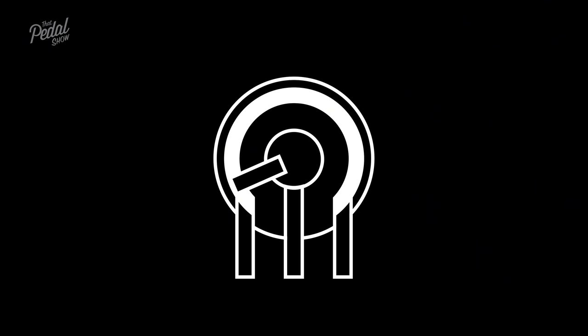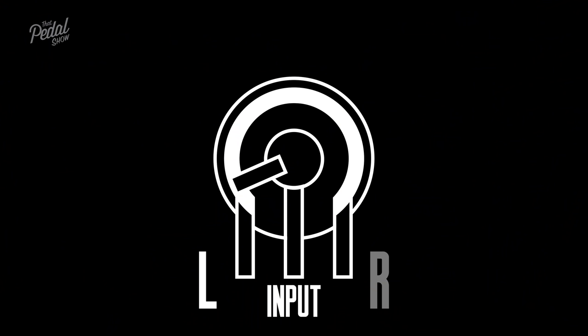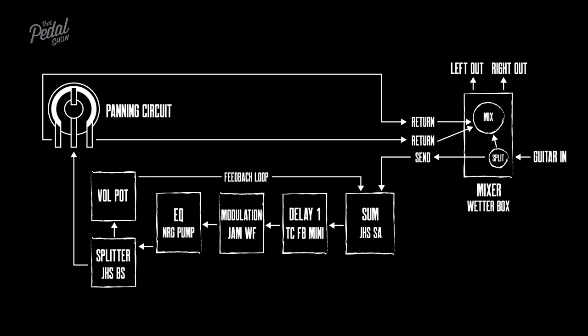If I have my pot right in the center, and I feed my input to that center leg and have the outputs left and right on the outside, I'm sending an equal amount of signal to both left and right. If I turn it one way, I have less resistance to the left output, so I increase my signal to the left-hand side and decrease it to the right-hand side, and vice versa. In the simplest terms, that is how we connect out left and out right to the outputs, and that's how we control which side we go to.